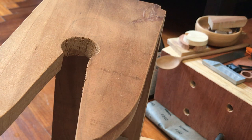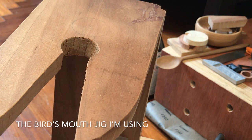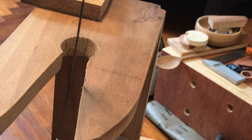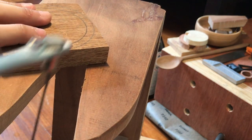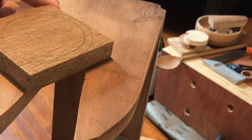This jig is actually just a way to extend the height at which I can do my sawing with the coping saw. Because I want to achieve a vertical cutting motion with the coping saw, if the bench is too low to the ground I'm not going to be able to hit certain points. So what I've done is create this jig that elevates it. You could basically just put a bench or stump on top of the table and achieve the same effect.